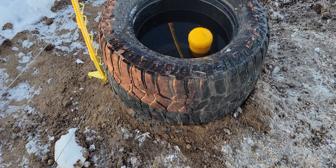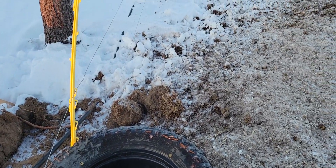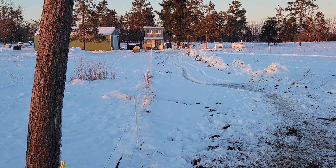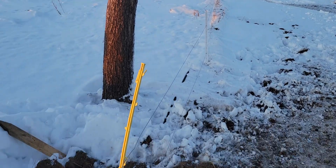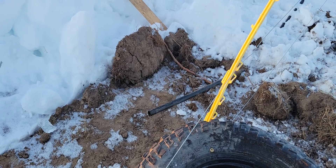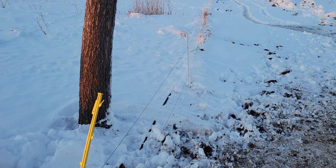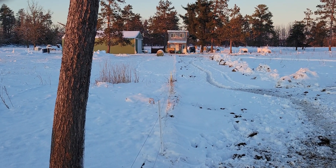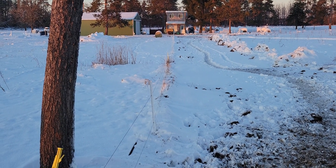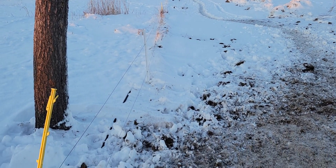It's going down to the water table, and then I have an eight-inch drain tile buried all the way to that gray building down there. I have a one-inch water line — just like that one there, which was my above-ground line for summertime, which I'm going to be abandoning. Anyway, that one-inch water line runs in the drain tile, buried at groundwater level, about five feet down to the bottom of the trench.